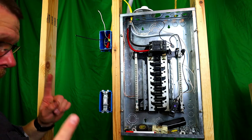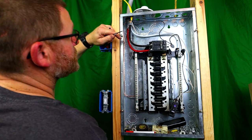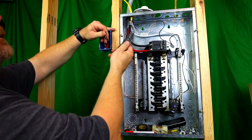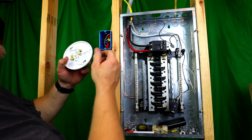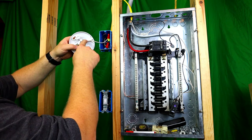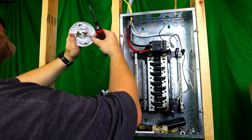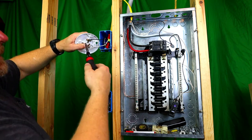Now we have the light left. What I told you about that was hot and neutral, right? Because that's what you have left. So we're going to cut these off and strip both at the same time with the dual strippers. We're going to make our little loop. I'm going to grab our keyless fixture — the silver screw on any receptacle or fixture is always your neutral, and brass is always your hot. Remember, we're going clockwise, so you want the long part of the wire with the short end up on top. We'll tighten these down. Make sure they're good and tight.